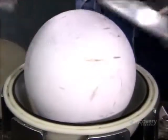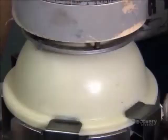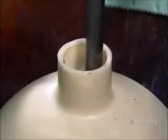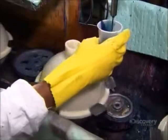Next, it's into a third mold. This one will seal the bowling ball in an outer skin called the veneer. This veneer has been scientifically formulated to enhance the ball's traction as it hooks towards the bowling pins. It's made of colorant, plasticizer, a chemical called ISO, and urethane. Blending these ingredients produces high-performance polyurethane. As the mix flows into the molds, a chemical reaction causes it to heat up and solidify in just seconds.